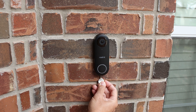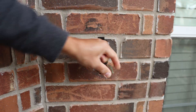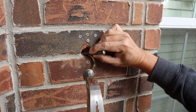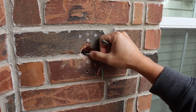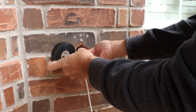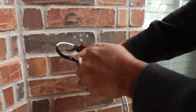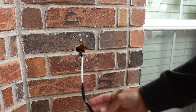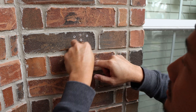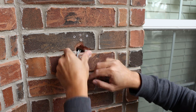From the outside, I'll first remove my Reolink doorbell and disconnect it from the wiring. Then I'll make the hole bigger using a punch and a hammer, slowly and carefully making sure I'm not going to cut or mess up the wire. Then I'll tape my new doorbell wiring to the old one, and a few inches down, I'll tape my Ethernet cable to the new doorbell wiring. As you can see, I decided to use Cat5e, mostly because of the overall thickness — it's smaller than a Cat6 cable — plus it's more flexible.